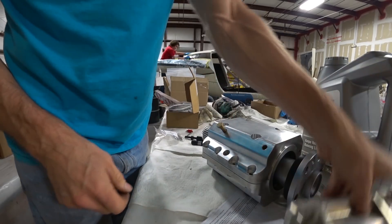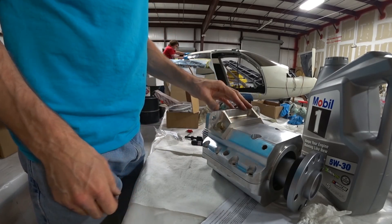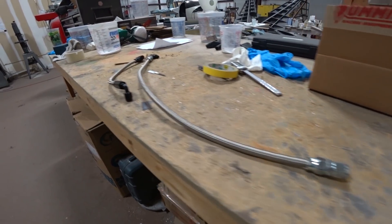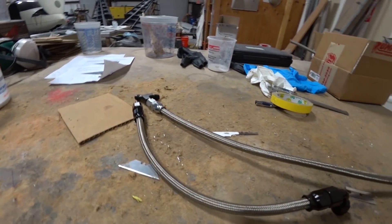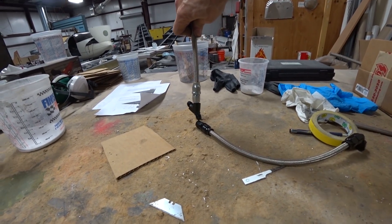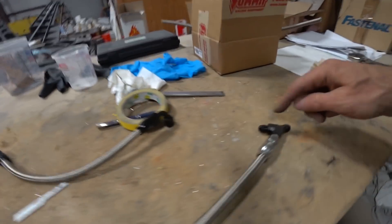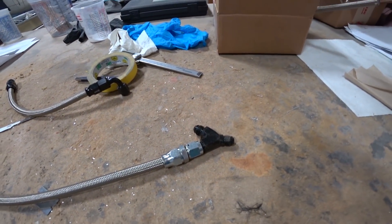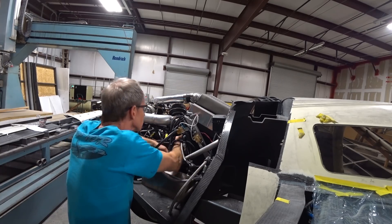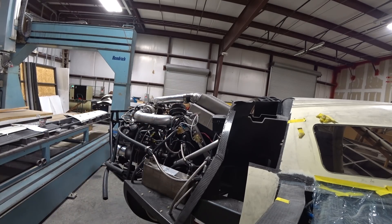The last things left on the redrive are the dowel pin holes and waiting for brand new journal bearings, since the old ones got a bit marred from testing and fitting. In the afternoon I moved on to creating the oil feed lines — modifying one and creating a longer one. There's a Y-fitting: one line comes from the engine oil feed, one goes off to the governor, and the third will head to the new redrive. I'm test fitting the first two lines — still need to create the third one to the redrive and the return line that goes back to the sump, which also has to Y in with the turbo return.